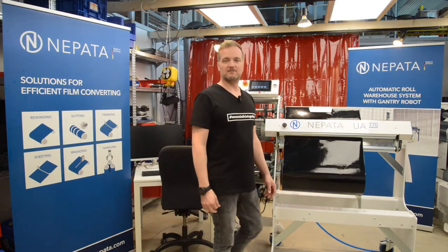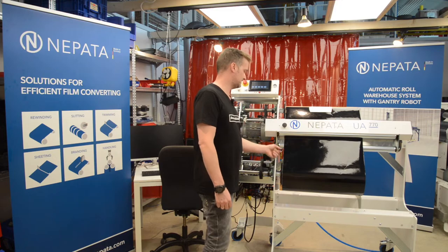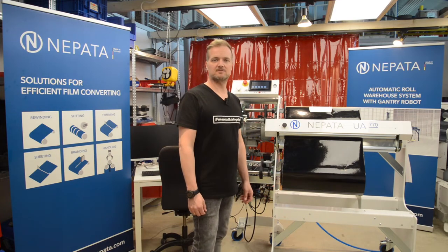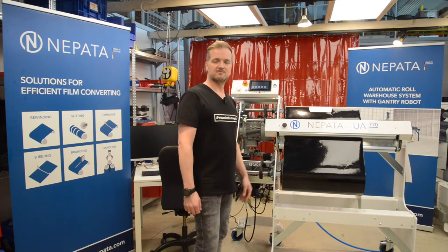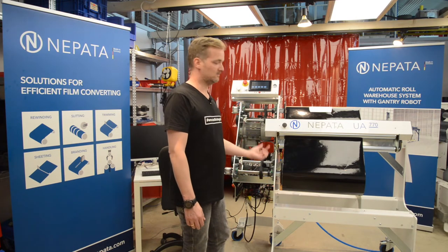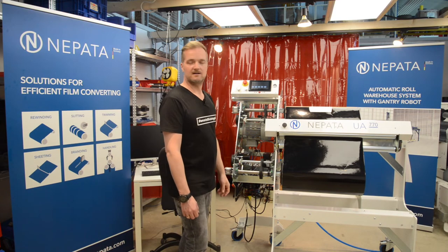We are back from our break. Loaded onto the machine is a 250-meter roll of pressure sensitive vinyl — a normal PVC vinyl with silicone paper. We want to show you a 10-meter rewind. The prototype is not yet able to do a cross cut after the rewind, but it will be. It will rewind 10 meters and stop very precisely at the normal cutting position, and you can see in what short time we can brake the roll to a stop without unwinding more layers of material, which would be the case at the highest possible rewinding speed on a current rewinder.